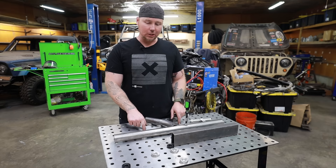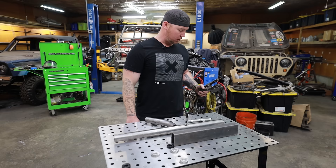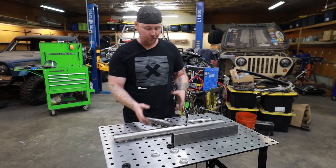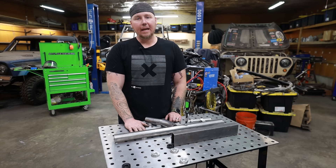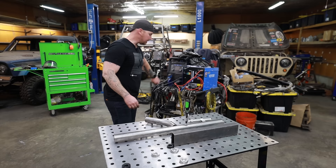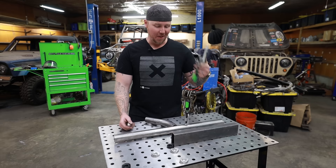I think there's a lot of value in buying something less expensive because you're just not as worried about destroying it. Also, if you want to ground through the table to weld — those of you who have done a lot of welding know that sometimes laying stuff on steel gives you a bad ground and it'll arc — if you're trying to take care of a really nice surface finish you just can't do those things. You're going to be treating a ten thousand dollar table like a ten thousand dollar table. Plus this comes with so many accessories — when you buy five of these you've got a boatload of fixtures for all different projects.